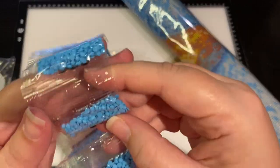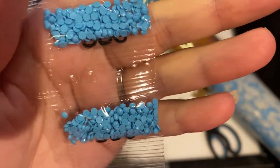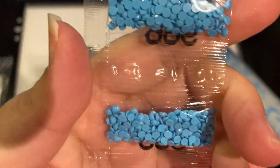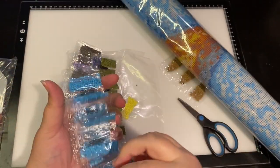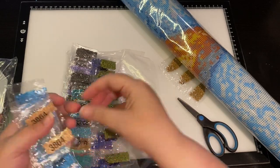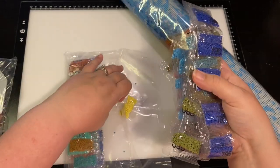The drills look pretty good. Usually I'm looking for white powder in here — that's used to help oil not stick, because they do oil the machines and that oil gets on your drills. I can see some here. Let's stick this back in.